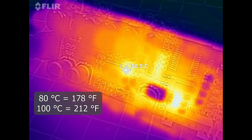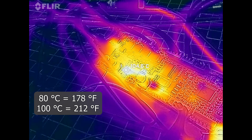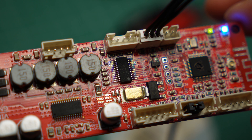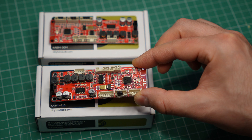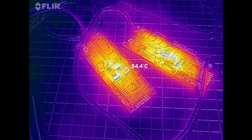Another thing I noticed is that the boards get hot. I measured around 80 degrees Celsius without any music playing, and at high volume the temperature can get close to 100 degrees Celsius. I cannot identify any of the chips on the boards, so I cannot look at their data sheets to find out how much heat they can handle. In any case, I'm not sure how long these will last without heat sinks. Both the KABM215 and the 30M seem to use the same hardware and the same chips, so they both have the same issues with heat and high power use when idle.